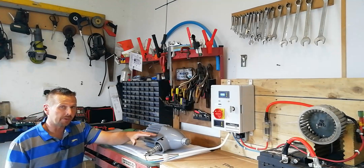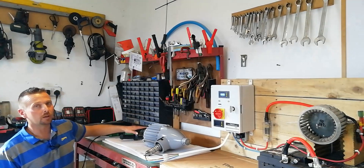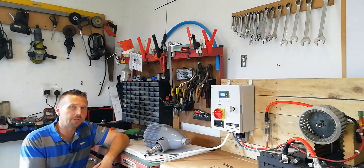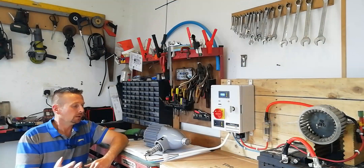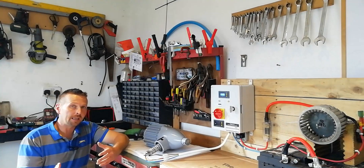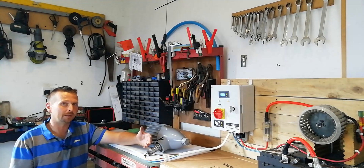There are a lot of other takeaways from this as well. Unfortunately I had to cut the test short because the drill was beginning to burn out — and this is a 700 watt drill. We were putting in 700 watts and all we got was 200 watts out the other side, which kind of highlights the inefficiencies of these generators. However, last year during normal operation we managed to get a reading of 34 amps at just over 26 volts in a 28 mile an hour wind — I'll leave a link to that video in the description. That would indicate just how efficiently the blades work, but it does beg the question of whether there was over 2000 watts of potential wind energy available that wasn't being harnessed.